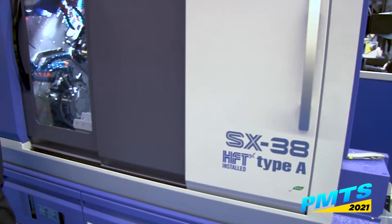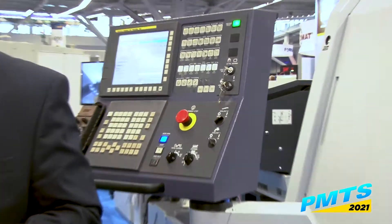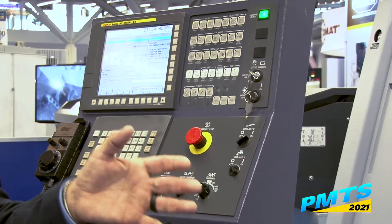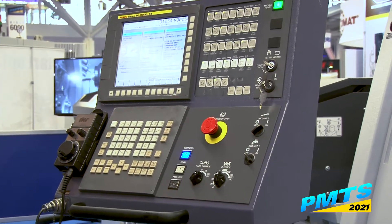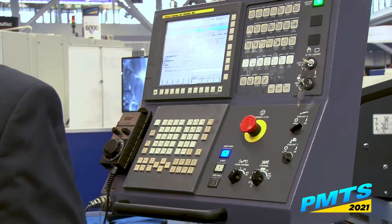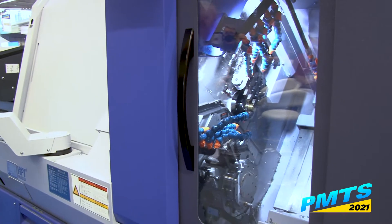Without the guide bushing, the only restriction is you have to be within two and a half times that diameter for the length of your part. Your headstock stroke goes from about 12 and a half inches down to about three and three-quarter inches. One thing that really stands out on this machine is the actual size — Star builds a very robust, rigid machine with strong castings and a strong base, especially when machining harder materials where you need to absorb a lot of harmonics. The machine itself is about 13,000 pounds.